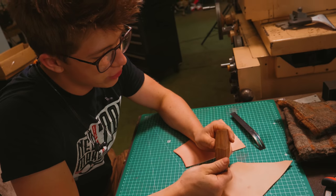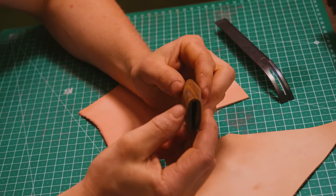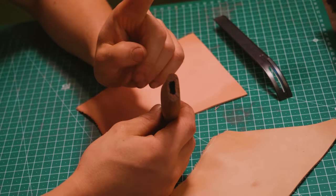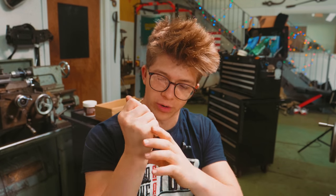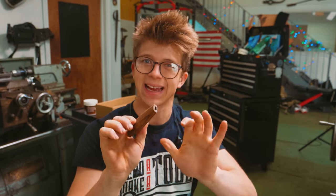The cocobolo has been roughed out, it's at a 320 grip shape. Something interesting you might note is the backside doesn't look square to the front, and there is a reason for it. We are going to have a twisted, canted pommel anti-clockwise, and that is all part of the short grip — all part of how the original falchions would have had their pommel assembled. In the grip itself, we're going to get that cant started.